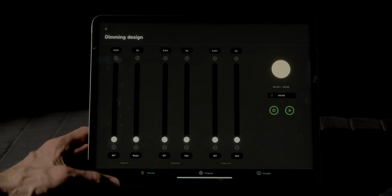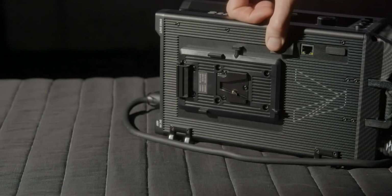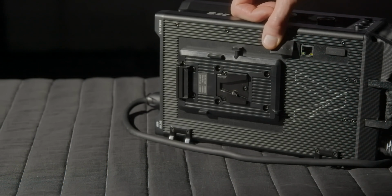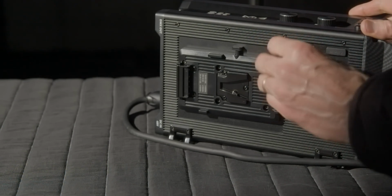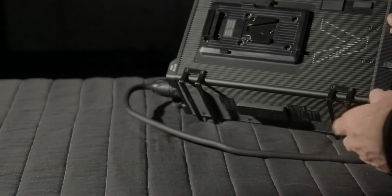It also now is capable of connecting with Lumen radio, so CRMX. Again, this is something you're more likely to see on high-end production sets and also perhaps in studio lighting and even stage lighting. So you've got another wireless option there. Now, there are also 2 wired Ethernet options. Again, these are probably more common in stage lighting, but you have ArtNet and sACN, which stands for Streaming Architecture for Control Networks. So, 2 options where you can connect this via Ethernet and control it in your overall, basically Ethernet-based DMX system.